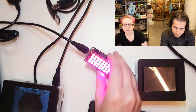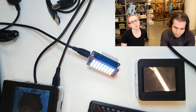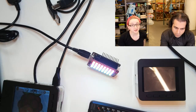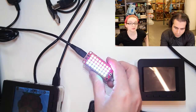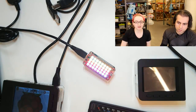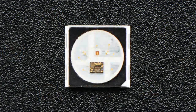Right now we're just selling them as individual LEDs — you get a strip of 10. You can solder them by hand. They seem to be more durable than normal Neopixels, so you can solder them a little bit better by hand. I did this in the reflow oven and it was pretty easy. It just lets you pack more pixels. We have them in a white plastic and also a black plastic, so if you have a black PCB, it gives you a little bit more contrast.